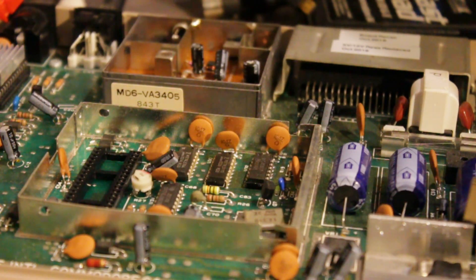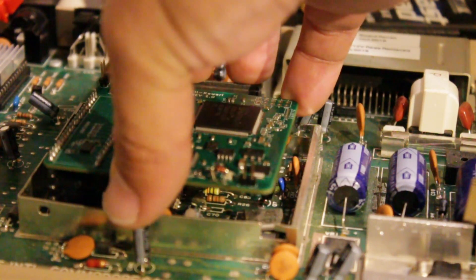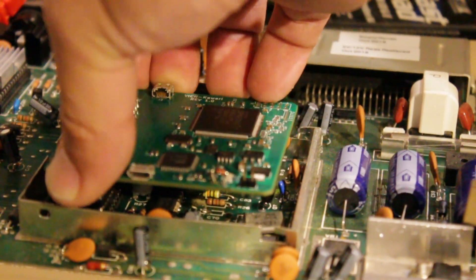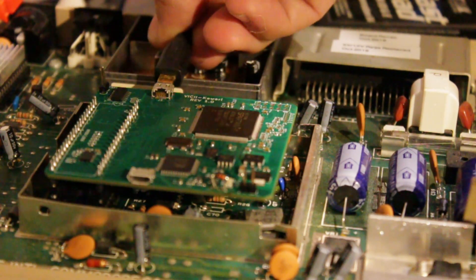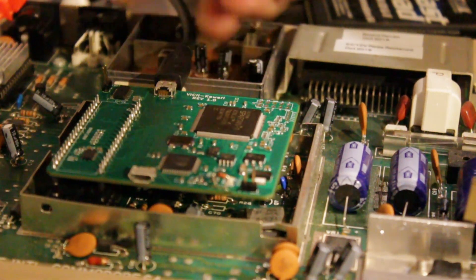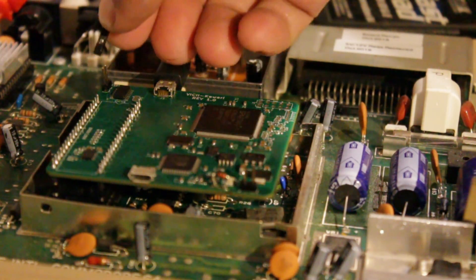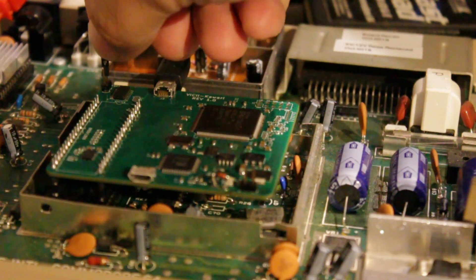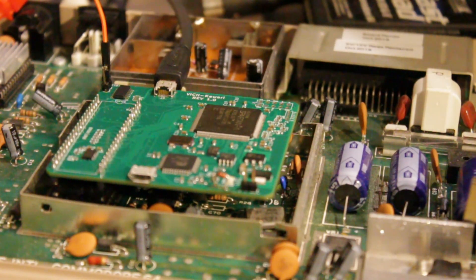This actually does fit entirely inside the shield in my 250407 board, although I've added a couple of extra sockets underneath to give it some height so the HDMI connector can plug in without having to remove my RF modulator or the shield. It's still too wide to plug directly in without the extra sockets, although if you squish down some components on the right side, it could work.